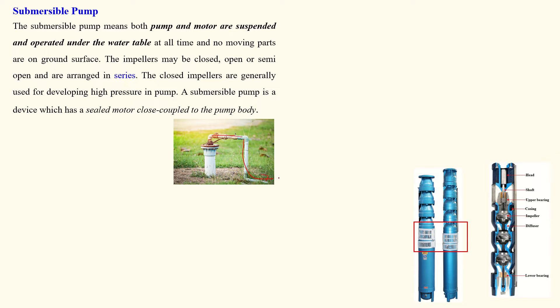Simply the electric wire cable and outlet pipe are above ground, and from here water will go to the fields. In the impeller, the vanes are backward-curved, like a centrifugal pump, and may be open, semi-open, or closed. These types of impellers are used depending on our need. When pumps are arranged in series, the impellers are arranged on a common shaft to achieve maximum head. When arranged in parallel, you get maximum discharge.